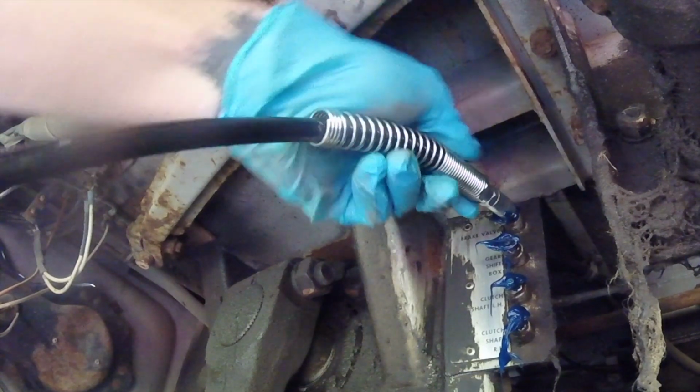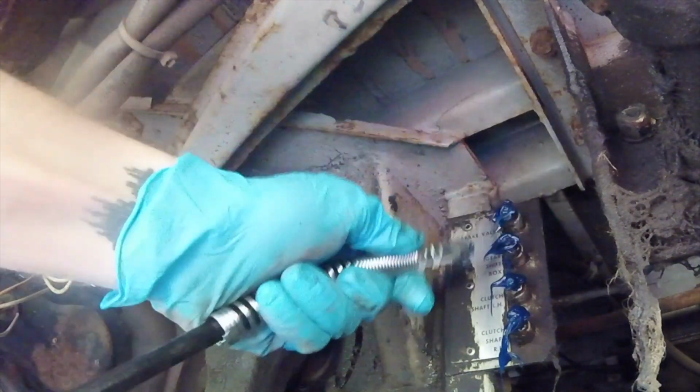All right, guys, so now that I got all the grease points up in that little bay covered with my left and right hand clutch linkages, gearbox, and brake valve, I'm now gonna move to the power steering. I've noticed while I'm driving, I'm getting a little bit of a groan, so I do have the recommended oil type for this. It is low. I can't get the camera quite in there without mucking up the camera to show you the sight glass, but it is quite low. It's gonna take almost a whole capacity, actually. It's dangerously low. So before I'm driving, I'm gonna get that topped up.